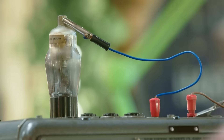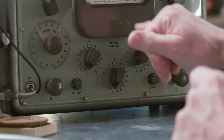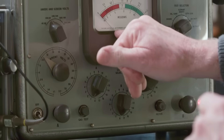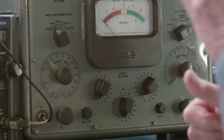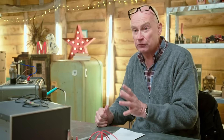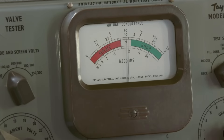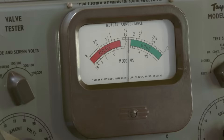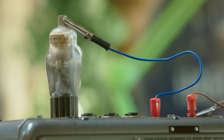This is a valve tester, which will allow me to prove if the valve is still suitable for use. When I press this button called meter, I then expect this little meter pointer to move to 0.9. If it's around that figure, the valve is like the day it was produced. Look at that — way over. So the valve is actually brilliant, absolutely spot-on perfect. That is as good as the day it left the factory.